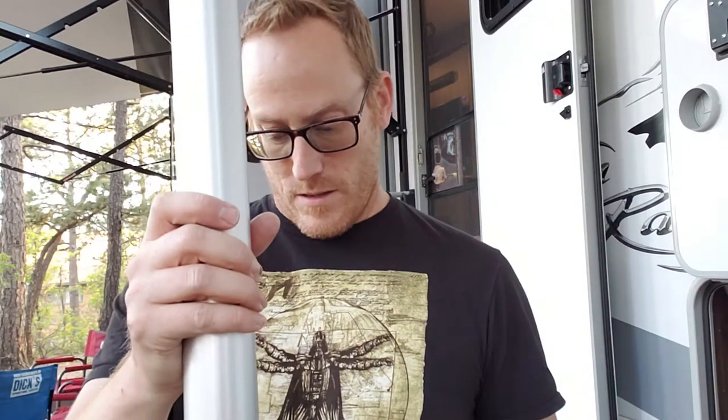There's 6 screws on the base, 6 screws on the table side. I'm actually going to be installing 4 of these onto my table in the corners so that it's nice and stable, which is why I had to put a band around with the 1x2s. So I am going to use a depth gauge on my drill so I don't drill through my brand new countertop. And I'm going to be using 3/4 inch by number 10 screws to install these. We'll get started.